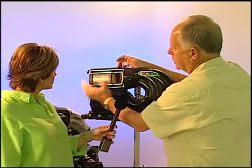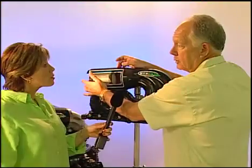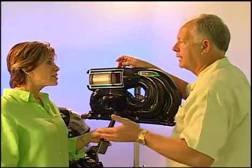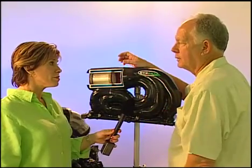The other thing is the catalyst is serviceable. The O-ring is a snap ring, so we can press a new catalyst in or out if you had to. If I ever had to. If you had to. Right now, we're required to test them to 480 hours. So you've got 480 hours that we've tested and confirmed that the catalyst will live.